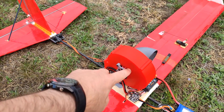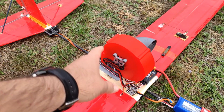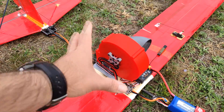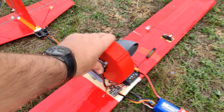What happened? Probably I just overheated the motor because the cooling in the setup is rather non-existent. The motor was running at full power, even at 3S — because this is only a 3S and the motor can run on 4S — but I knew that the efficiency and the amount of heat would be a problem. The motor overheated.